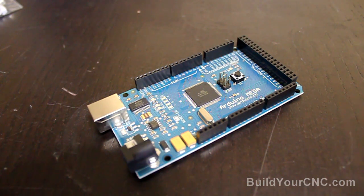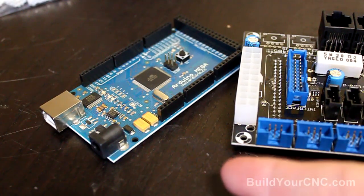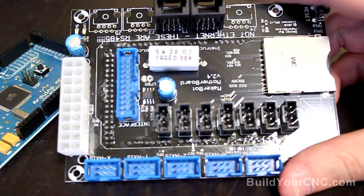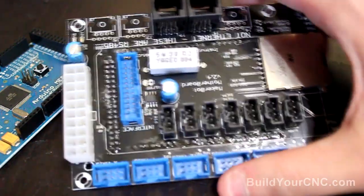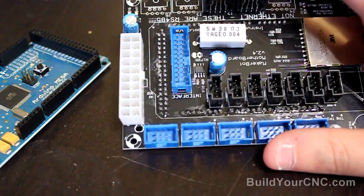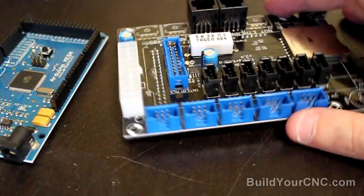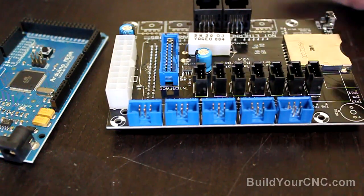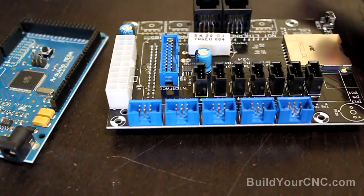The 128 is sufficient for use in 3D printing. A strict Arduino is able to be used with the aid of the new motherboard that they've come up with. This motherboard really is just a shield that goes over the Arduino using these pins, and it essentially just takes these pins that are on the Arduino — you can see them around here — and distributes them to common types of connectors that are easier to connect to various components like the stepping motor drivers.